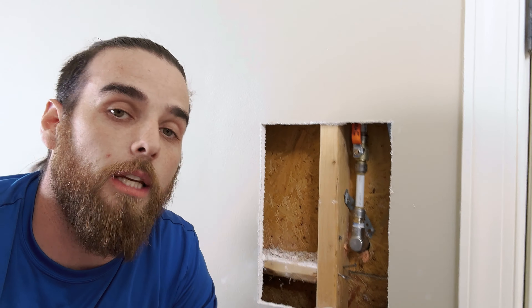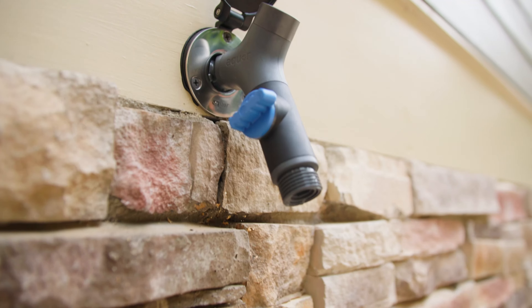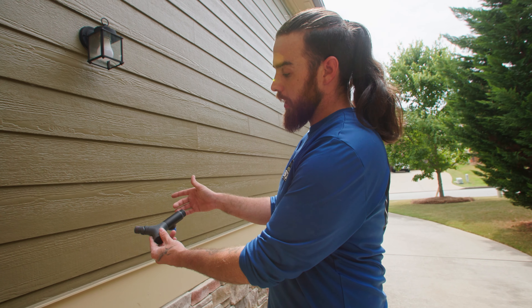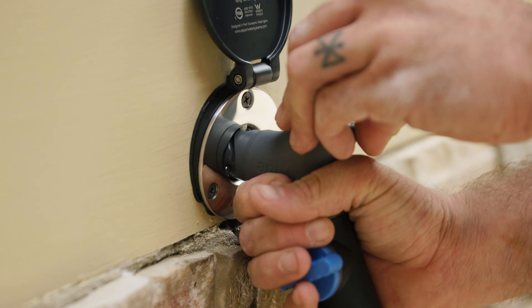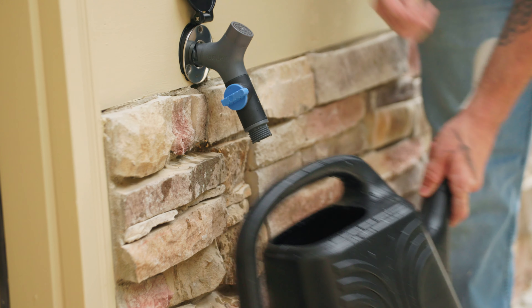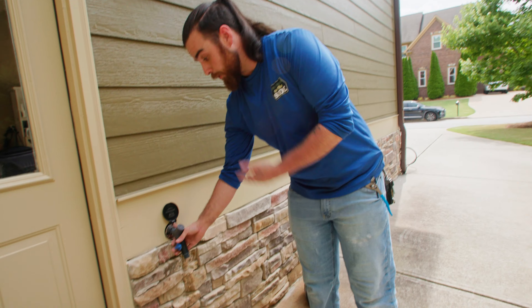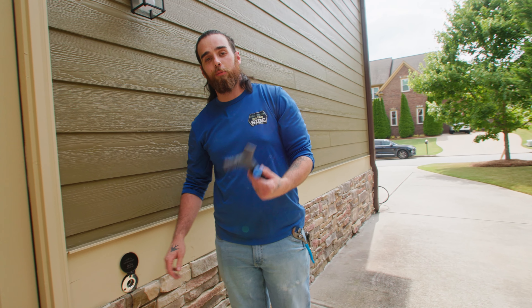Let me show you outside. This isn't running any water even though the ball valve is wide open — until I actually put the hose connector onto the house, I'm getting no water out of the system. Bone dry and ready to go. Now I just need to get the comfort grip hose connector attached to the hydrant: hold it at roughly two o'clock, line this arrow up with the top groove, and it's just a quarter turn down into place — and I have water. To winterize, just release the pressure before removing the connector or you'll get wet, then store the connector inside.